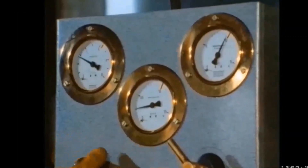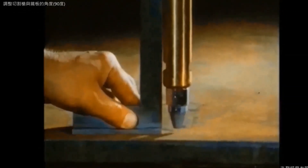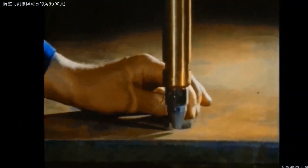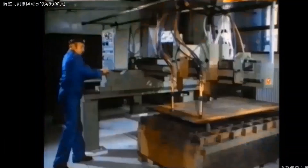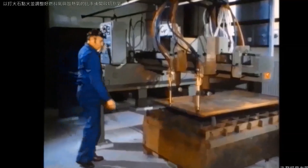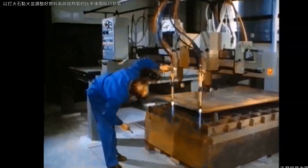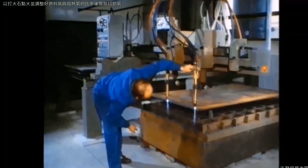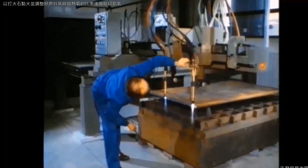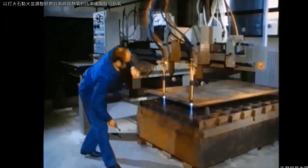Other prerequisites for good flame cutting are exact alignment of the torch to the workpiece, technically perfect condition of torch and nozzle and of the entire cutting unit, neutral setting of the heating flame — that is, correctly proportioned mixture of fuel gas and heating oxygen — and lastly, the right distance of the nozzle from the workpiece. These influencing factors will be examined separately later on.